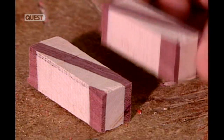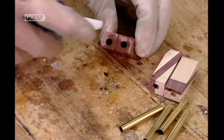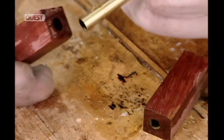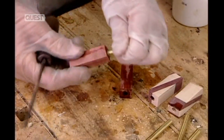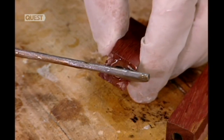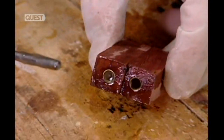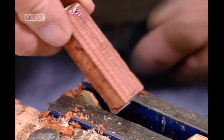Again, he cuts pieces for the top and bottom casings, then drills a hole through them. From this point on, whether one or more woods, the process is the same. Two brass tubes are coated with glue, and each one inserted into a casing. A few drops of water are added to expand the adhesive into any gaps between the tubing and surrounding wood. These brass tubes will house the pen's mechanism. The glue takes about an hour to dry.